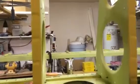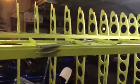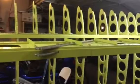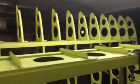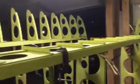The right wing is ready to start riveting together. I've been holding off because I was going to put a pitot tube mount right here, and then I realized — wait, this is the right wing, and I sit on the left side as pilot. I want the pitot tube on the left side, mostly so I can look out in flight and see it if something weird starts happening. Moreover, the only door for the pilot is on the left, so this will eliminate somebody whacking their head into it or grabbing onto it.